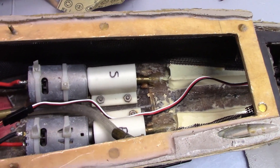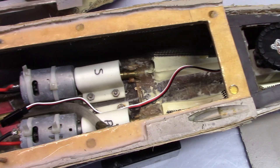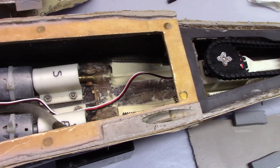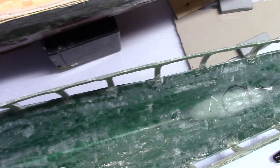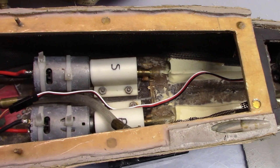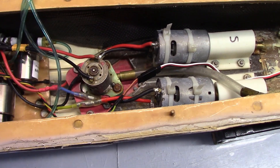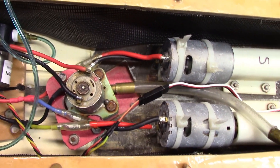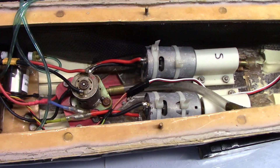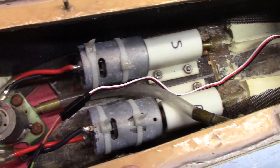Then will typically be the motors. Whether the motors are in front of or behind the gun location depends a lot on the specifics of the boat and the armament. For the Lutzow and also for the Indianapolis, the motors will be forward of the guns. Usually forward of the motors — or sometimes between them, depending on how wide the ship is — will be the pump. You want to plan for that location. It's a cruiser, so there's a pretty small pump. You'll also want to think about where your pump tube is going to go so it can deconflict and get out of the boat.